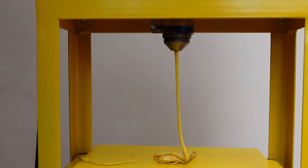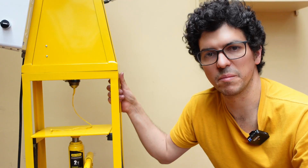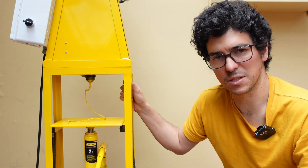After 25 minutes, the plastic is already melted inside the barrel. So now we're going to put the mold, press it against the barrel, and make the injection. A tip here is that you should make this process as fast as you can — place the mold, press it against the barrel, and do the injection in the minimum time.